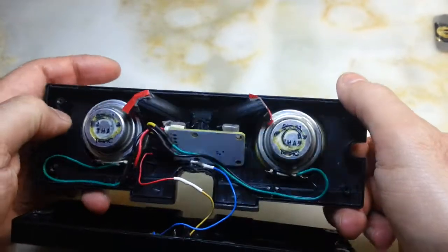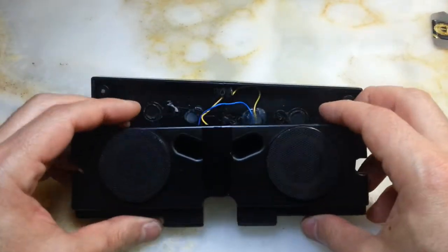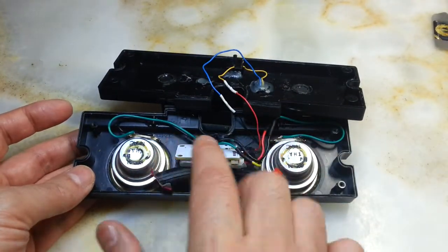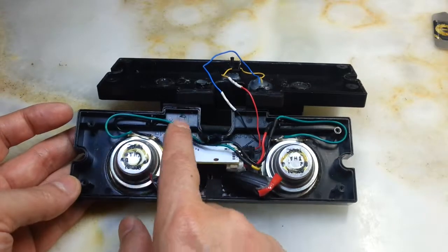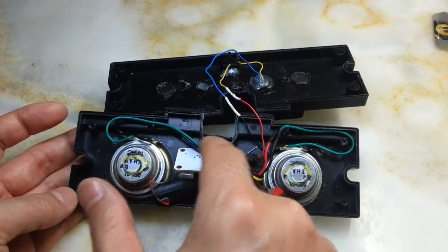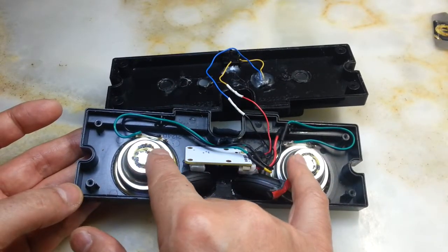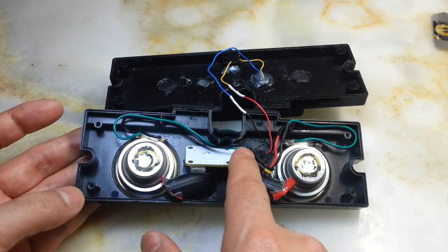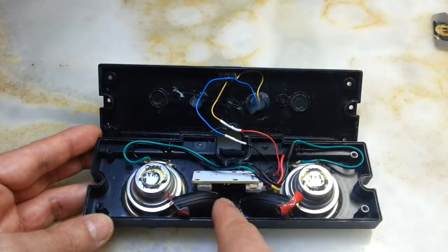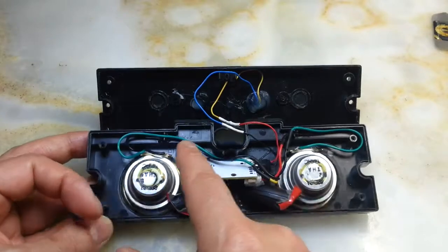These two speakers I think can manage better amplifiers, but at the moment I can't find any amplifier that can fit in here that is 5V and Bluetooth. The space here is really restricted. On each corner there is not much space, and if I want to use a TPA3110 it's too large and you cannot run it with a 5V power bank, so you'd have to use a boost converter to lift up the 5V, and then you'd have to store it somewhere — but there is no space here.